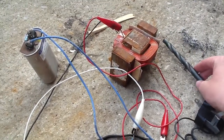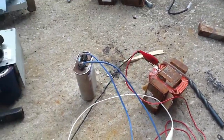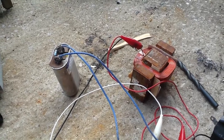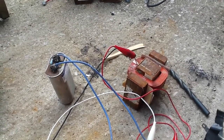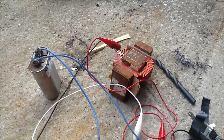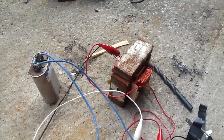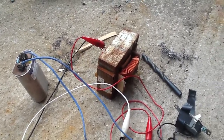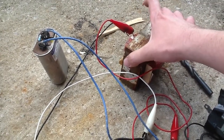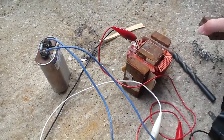So what do you do? Well, basically what I got here is just a microwave transformer, and I've connected a capacitor in series with it. The capacitor's size isn't too important — this one is 5 microfarads. I've cut off this part and removed the secondary. You don't have to remove the secondary, but I was going to scrap this anyway, separating the copper and iron out of it. You do have to cut this part off to do it the way I'm going to do it.